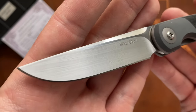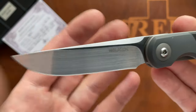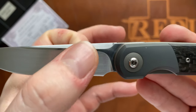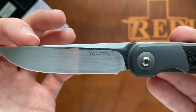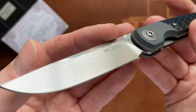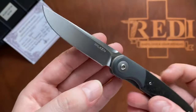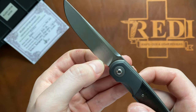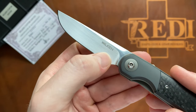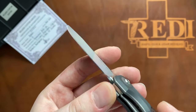Taking a closer look at the blade, we see an absolutely gorgeous drop point blade shape. There's a nice top swedge right there, and we have a polished flat area here. I love how this flat area goes all the way through and intersects with this nicely executed top swedge. Then we actually have a slight hollow grind on the blade which makes it nice and thin behind the edge. It's not super thin - I've certainly had thinner knives - because there's just not as much travel available with the integration of the top swedge. But it certainly is a great slicer.